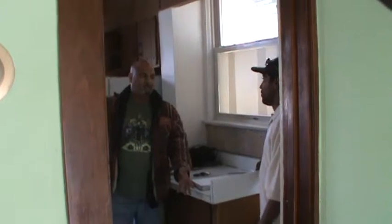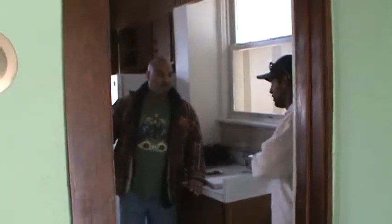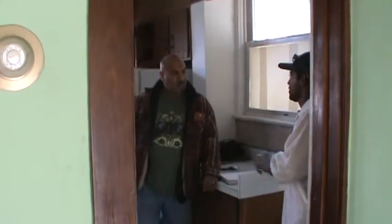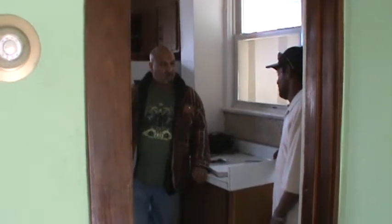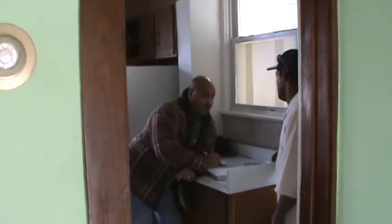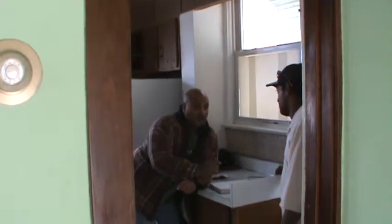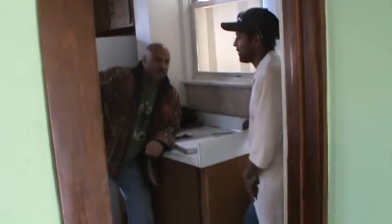There you need green board. Not everywhere. Most of it, you want to put green board? I'll tell you why. Not in this room down in the basement. Why are you going to put green board up? Because it doesn't mold. You're always going to have that problem down there. On the ceiling? Anywhere. A basement always accumulates moisture. Yeah, but green board is $2 more. We'll put the green board in the back area where there's moisture. But in the ceiling. In the ceiling, okay. Need it in the ceiling.